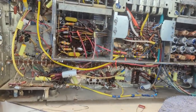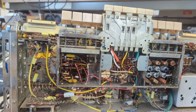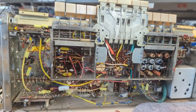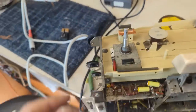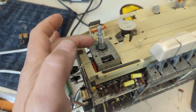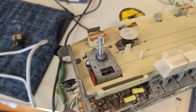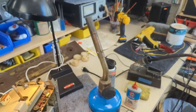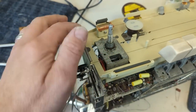All the capacitors are now replaced — not very fun, but it's done. I also cleaned all the contacts with Deoxit. Now I need to get the balance control moving again. What happens is the grease they used solidifies and you've got to heat it up pretty hot to boil it out, so I use a plumbing torch on low, heating this little area carefully — don't get anywhere near plastic or anything that'll melt. Luckily the tuning cords are all steel on this one.